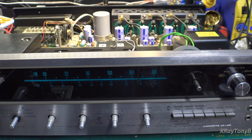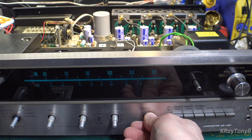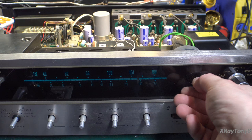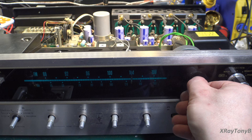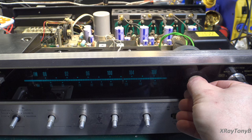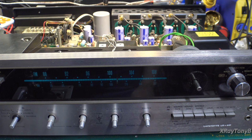That was really all there was to it — that tiny little sound. Let's turn it up with an antenna connected. I would say that is a really sensitive tuner. However, with the volume all the way down and the microphone right up to the speaker, it's got some pretty nasty AC hum, which tells me these capacitors are getting tired and need replacing.